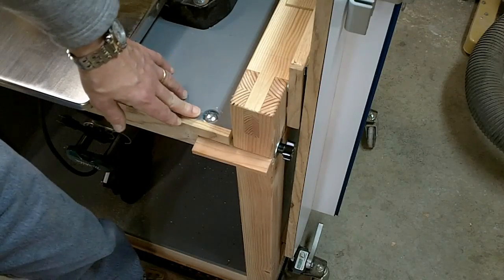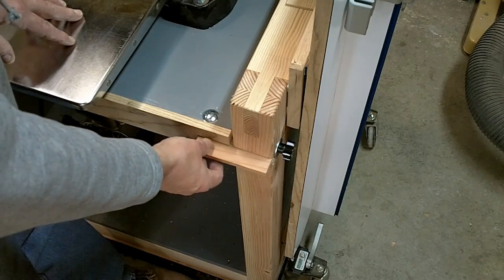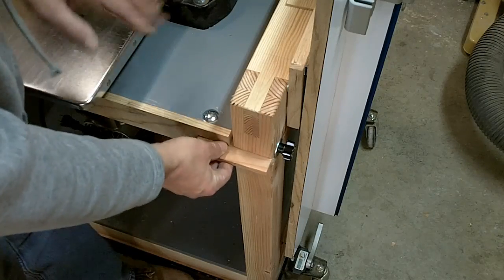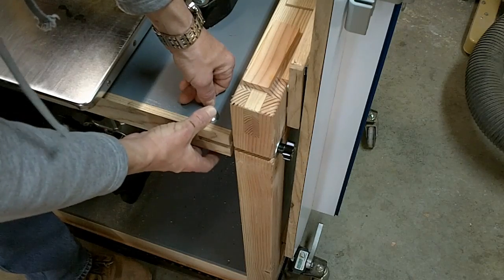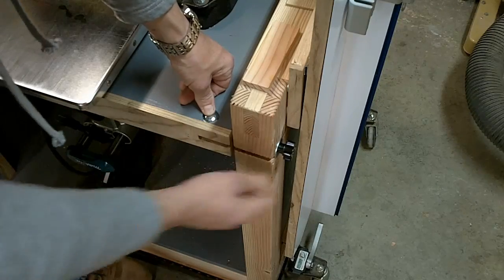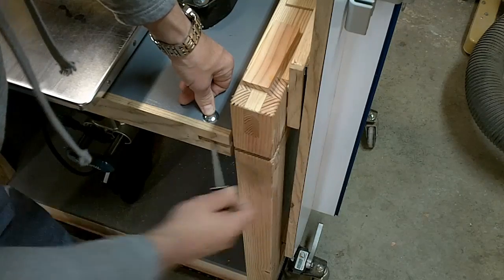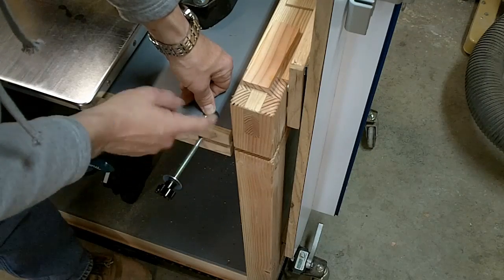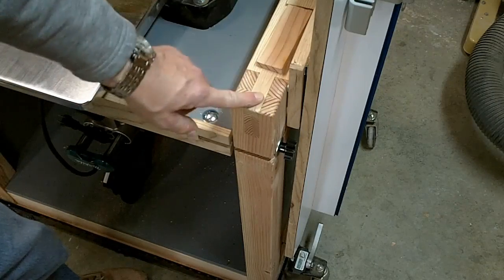This is the front of the machine. As you can see, there's a key in here. What this does is it allows me to slip this in when I lock it down for the miter and make sure the table always comes back in the exact same place. To flip this over, I simply pull this out. What I've got here is a carriage bolt drilled through with a slot and a mating slot. There's an eye bolt that simply unscrews and then swings out of the way. The eye bolt is pinned by that carriage bolt. Let me show you how this flips over — you can see the bridle joint here again, very, very strong.